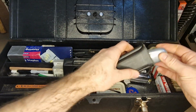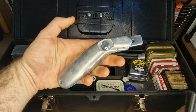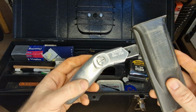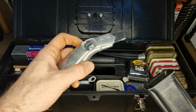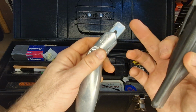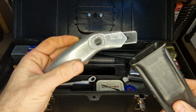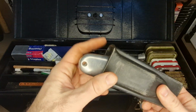I've got a very few heavy duty blades. This one's actually made by Crain. I think these are more common within American carpet fitting circles. They use these straight blades a lot more than us Brits do. But I really, really like them on vinyl, on concrete floors, anything like that. They work really well just because that little blunt bit just there, it's not going to get any blunter, and it just drags across the floor really easy without putting great big scores in it like you would with a diamond blade, or a triangle blade, sorry. But yeah, it's pretty handy.